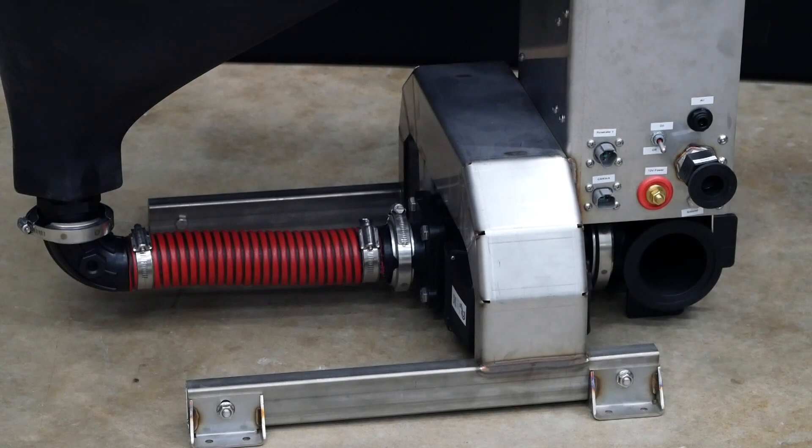This connector is for a 3/8-inch tube fitting — it's a push-to-fit connector used to supply air to our system. Air is one of the important parts of making our jug process so fast. When you have a jug that you want completely drained, you can put it right over the rinse nozzle and it will shoot air into that jug and drain it in about two seconds.